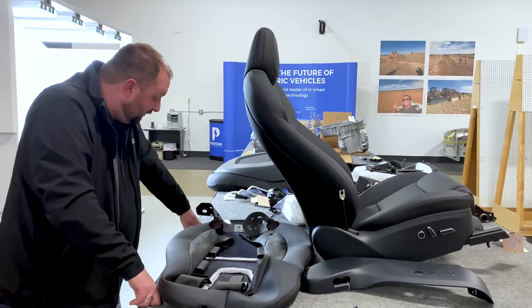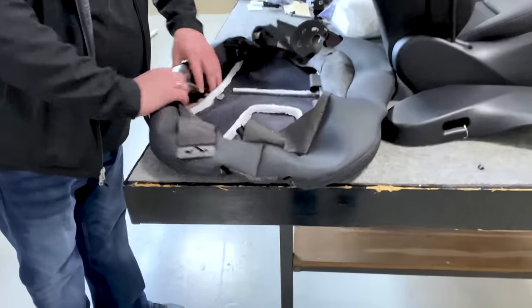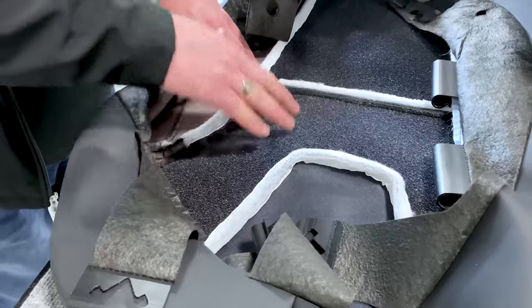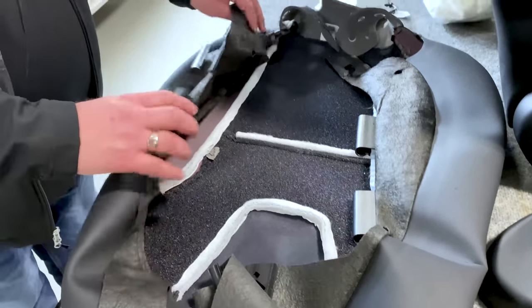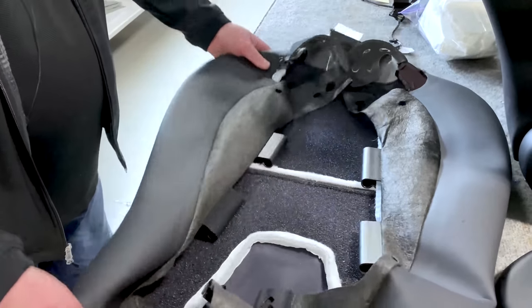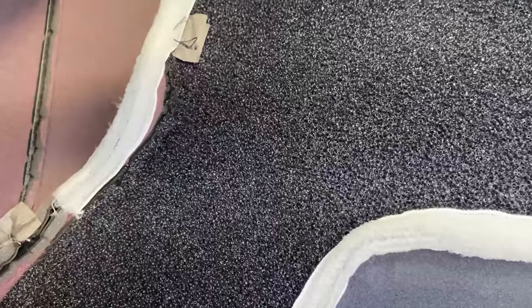I don't know how often you ever get a chance to look at a sewn seat cover. These things have multiple different materials. You have vinyls that are glued or attached to some type of foam. You have different densities of foam, different thicknesses of foam, depending on where you're at in the vehicle. And then you have your primary attachments. Hook retainers, J retainers, there are different types of profiles that are all sewn in. These covers are quite nice because they can normally pack fairly well so that you can ship them from low-cost countries for sewing if that is of a benefit to you.